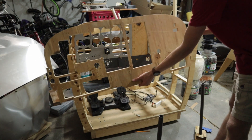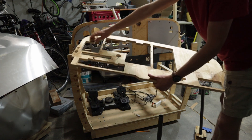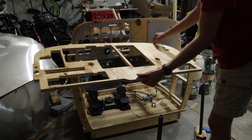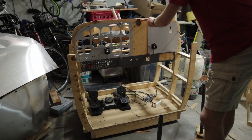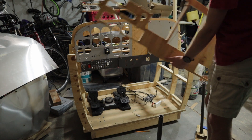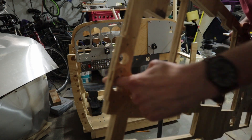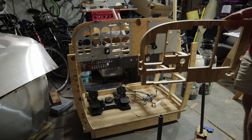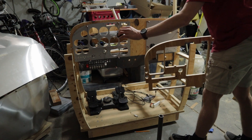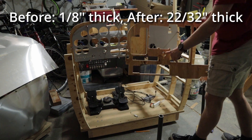This is the latest addition to my Cessna 172 project — it's a CNC milled panel, updated. It has this geometry up top, the shape is a little more realistic, and it has a support panel section here on the outside. I originally cut it with a jigsaw but that didn't cut it, so it's now CNC milled. That gives it a nicer finish and it has new holes that let air valves through, so I can have air conditioning in my simulator. Also the yoke grommet wasn't doing well with its previous design, so I fixed that — it's updated and ready to go.